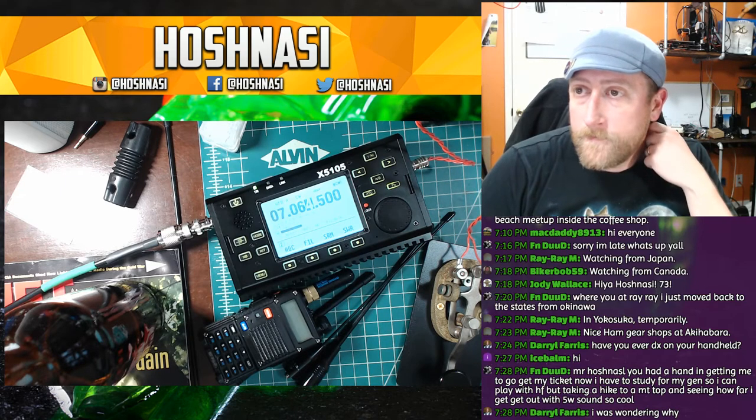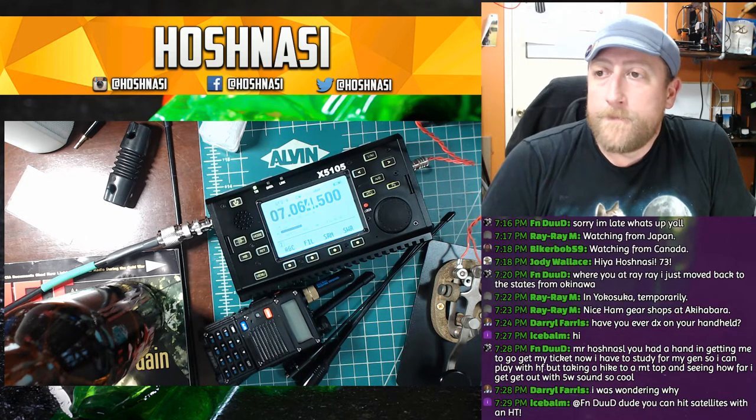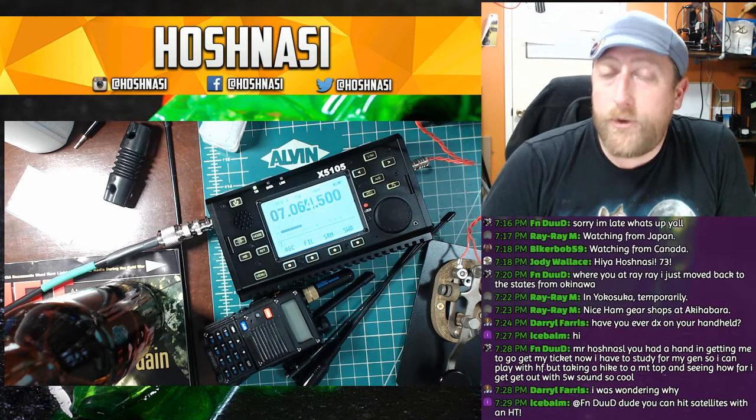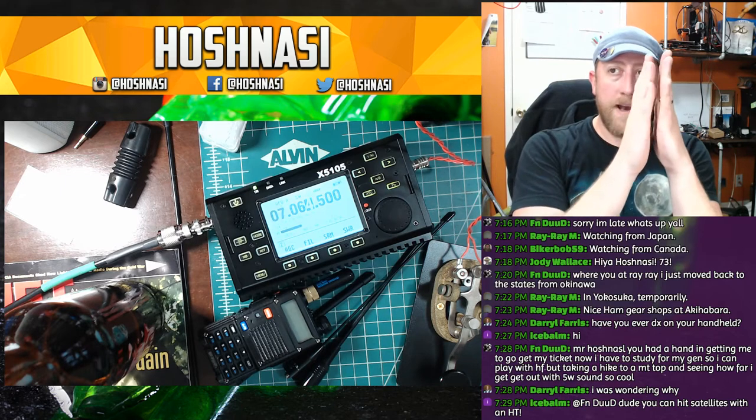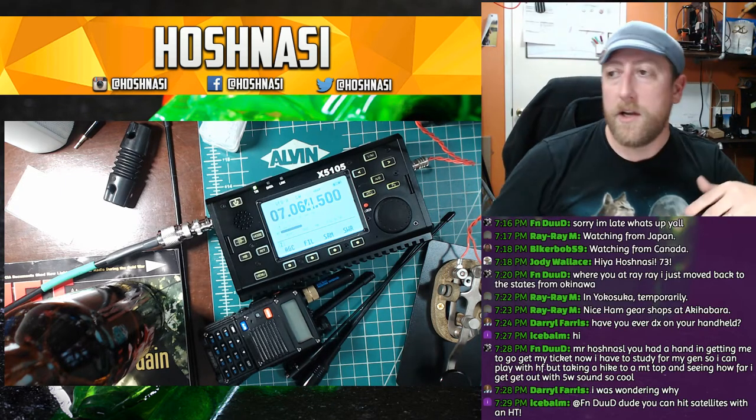Daryl says, I was wondering why you haven't done DX on a handheld. So the reason is most DX is on HF. And going back to the whole bandwidth discussion, most handhelds are FM. We're using single sideband, and digital is like the sliver of the sliver. And we're on HF, so we propagate further, right? So there's a combination of things that work for us in going further using HF than using 2 meter, 70 centimeter by nature, and also FM, which is not helpful. Hope that makes sense. If it didn't, please ask further questions.